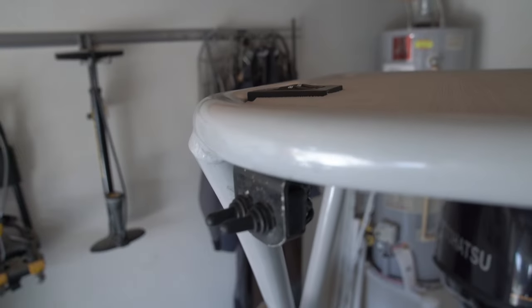As for the controls for the trim and tilt as well as the jack plate, I've got those located on the grab bar. So when I'm sitting in the back, I got my hand up on the grab bar. I can easily access trim and tilt. If I need to get to the trim tabs, they're basically right underneath where my left hand's going to be. I also have a second set of trim and tilt, jack plate, and trim tab controls up on the poling platform. So if I am standing up while I'm driving, I still have easy access to all these. And I'll be honest, a lot of times I forget after running to pick the trim tabs up, and it's really nice that I can easily throw my foot over there, push the trim tabs, bring them up without having to climb back down in the cockpit. Definitely 100% recommend controls for this stuff up on your poling platform.